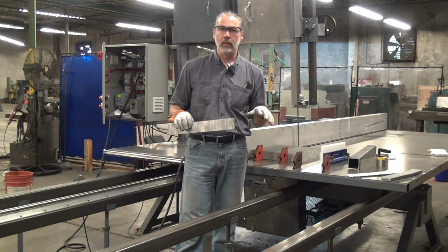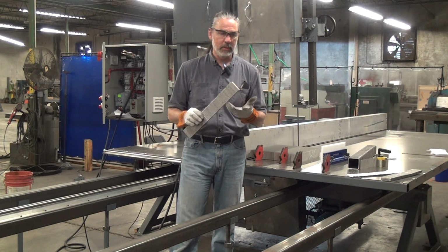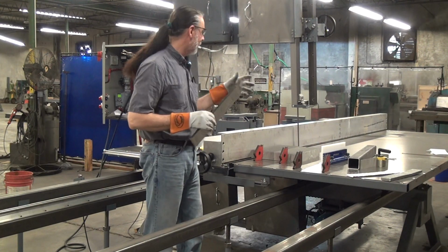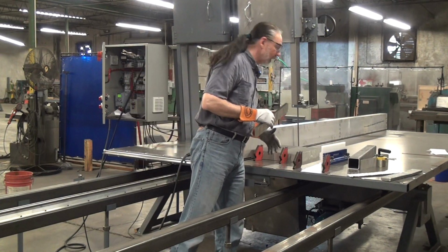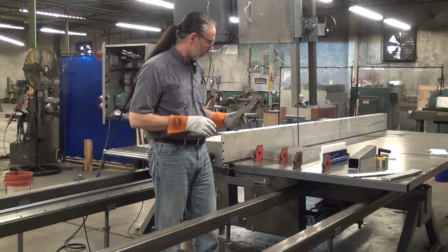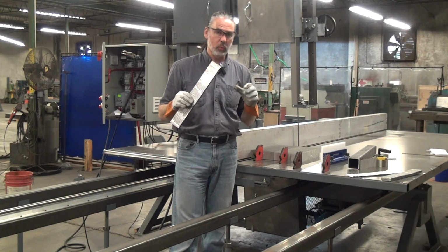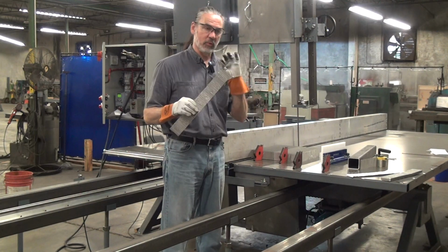It works great on the phenolic material, phenolic craft, the Nomex materials. It's doing okay cutting this material, but I'm cutting metal with metal, and the blade is going to get dull relatively quickly. I've made maybe 10, 12 cuts with this blade so far, and it's not noticeably going dull yet, but it's not going to last for weeks of this. So my first cuts here, I'm using this honeycomb style blade. I'll also use later on, not in this video, a 1-inch wide blade with regular teeth, but lots of small teeth, probably 10 teeth per inch, maybe 14 teeth per inch, lots of small teeth.